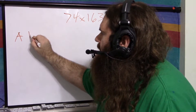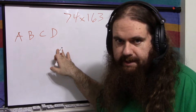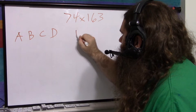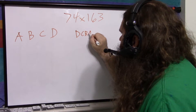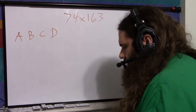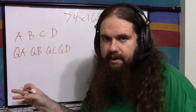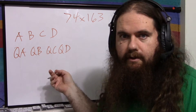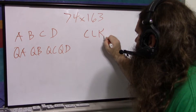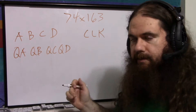But this one has the benefit of being able to set the value in a single operation at any time. It's got pins A, B, C, and D — these are the parallel load input data pins. D is the most significant, so DCBA as a binary number is the way the chip lays it out. QA through QD are the outputs — your actual 4-bit counting result. This is a clocked chip with a clock pin, active high, rising edge. When it goes from low to high, it'll perform an operation.